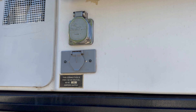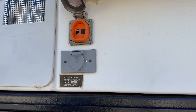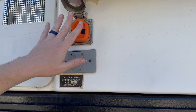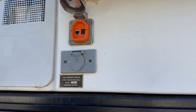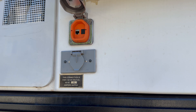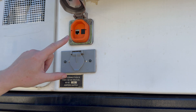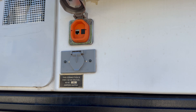In addition to using DC power, we're going to hook it up to this smart plug here. We previously installed this for our Starlink standard, which is powered over ethernet — you can see the ethernet connector here. We use this when we get to camp and just plug an ethernet cable in. It's a weatherproof, dustproof, marine-grade jack. We have this extra unused connector called a keystone connector, so we're going to install a barrel jack for power for the Starlink Mini right here, and then we'll be able to run both our Starlink standard and Mini while we test which one is best for us.